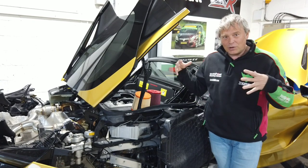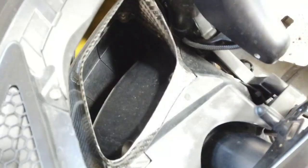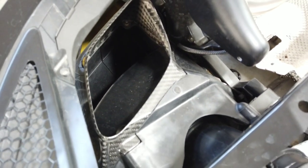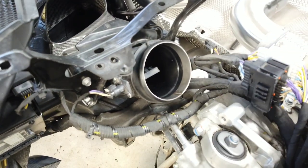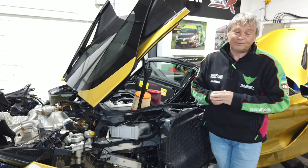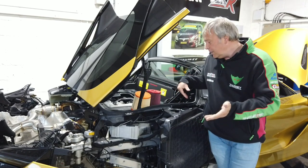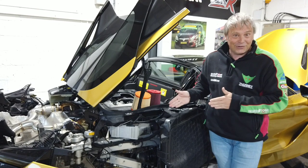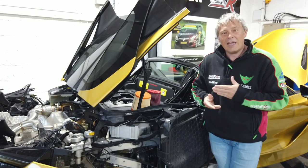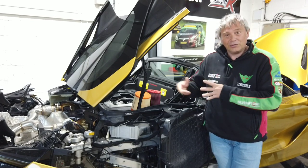Putting the intake at the back where you have negative air pressure and rotating air is the second-best option — ram air directly into a filter can overwhelm it, and it very rarely works on road cars unless perfectly centered on the car's centerline, otherwise you just get bouncing air. By mounting the intakes nearly a metre and a half away from the turbos — a hell of a distance in a car this size — the air stays nice and cool and has limited time to heat up before going through to the turbos.